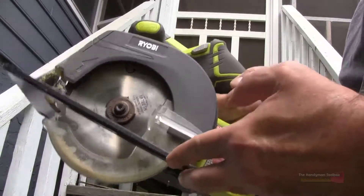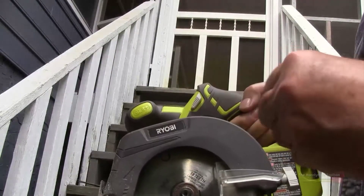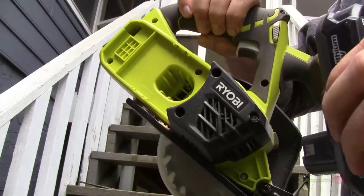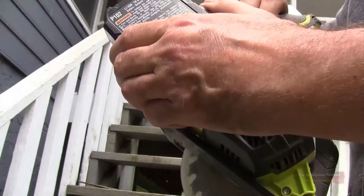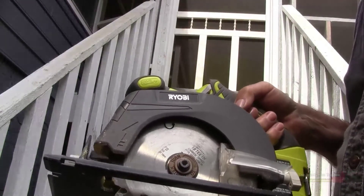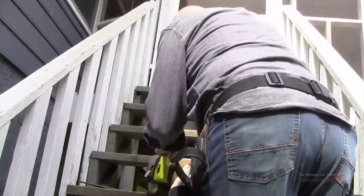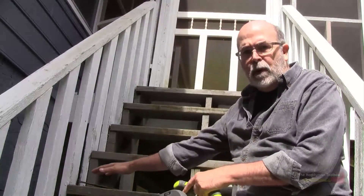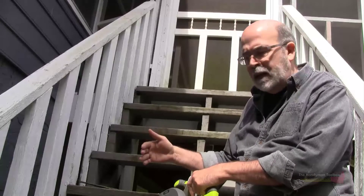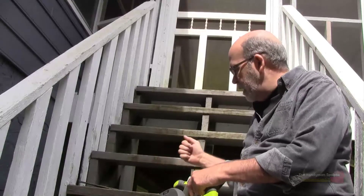Probably one of the best tools I've ever invested in is the cordless Ryobi. Ryobi years ago was not as good as it is now — and this is cordless and I absolutely love it. If you want to know the prices, I'll send you a link in the description. What I'm going to do instead of trying to pry this up is make my cuts off of the center. I have three points — one, two, and three — which are three stringers. I'm going to cut on either side of the center so it'll be much easier to remove.